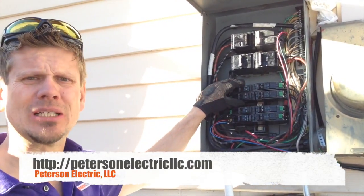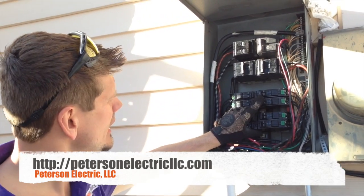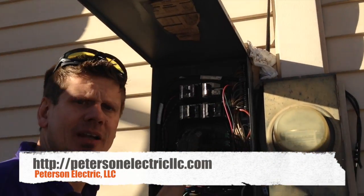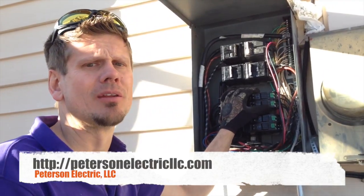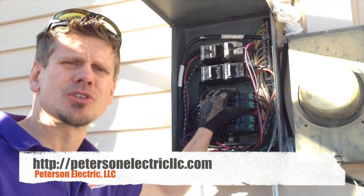So these are your lights and your outlets, and the two wires that come down are in the back, and these are actually manufactured here to these lugs. These are really not to code anymore. If you do any kind of panel upgrade, you're not going to find these to replace. The code now requires whatever the jurisdiction does — the AHJ, the authority having jurisdiction.